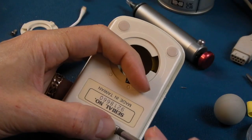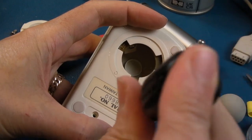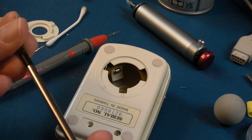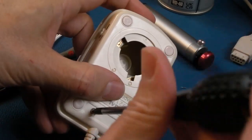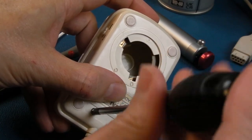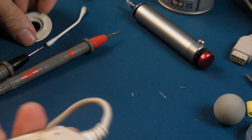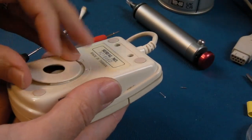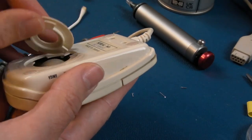And of course, it's one thing testing it without the lid on. As soon as you've got the lid on, any light coming out of that LED could get scattered all over the place. You may find that both directions don't work now. I'm talking from prior experience of messing with infrared LEDs. You've got to make sure you use the heat shrink thing. Just make sure you stop light from going absolutely everywhere, or your mouse sensors inside get blinded and go, what on earth's going on? I've got so much light here, I don't know what to do.